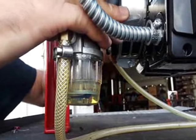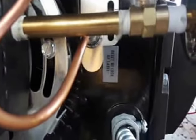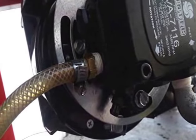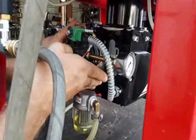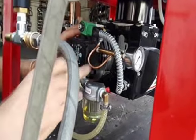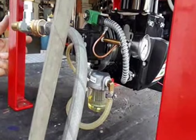There's also a side plate with a fine-tuning adjustment — a screw right here and one opposite on the back side of the fuel pump. We like to loosen them just enough that you can move things; they won't vibrate off. It needs to be checked once in a while anyway, but we leave it so that if you're in a hurry, you can adjust it by just grabbing it and moving it. This is ready for the guy who needs to go up and down in altitude and wants to make some quick adjustments.